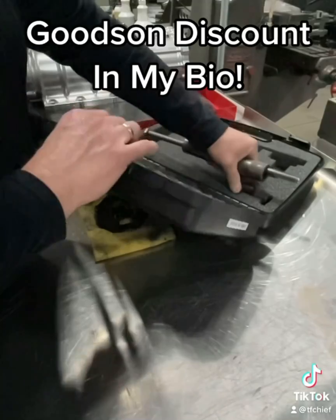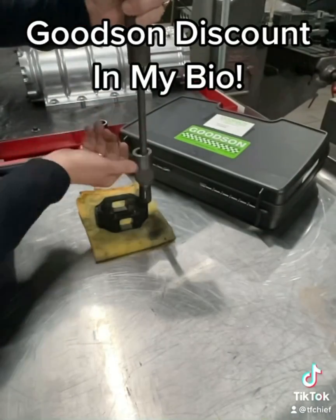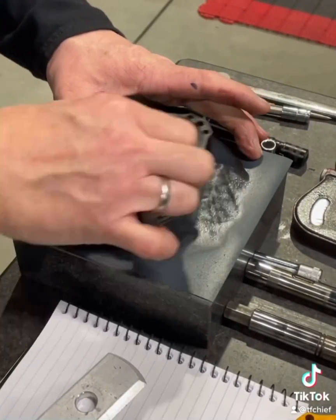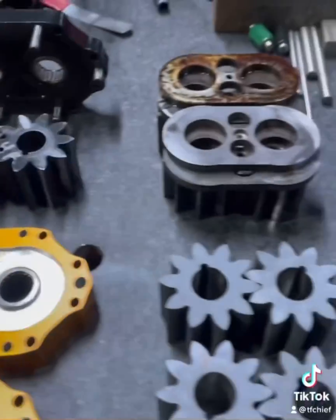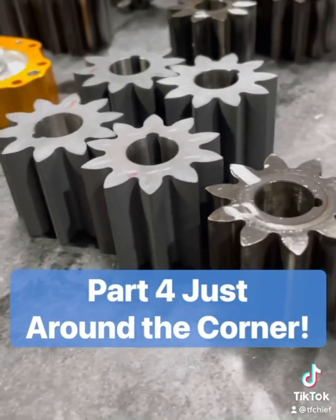I use this Goodson Dowel Removing Kit — just a cool little slide hammer that fits whatever size dowels you have. Once I get them out, I'll be able to sand these housings down and get all the nicks off of them so I can measure these things. We machined down this inner plate so we can put some larger gears in this thing to make this pump bigger. This is how much bigger these gears are going to be.